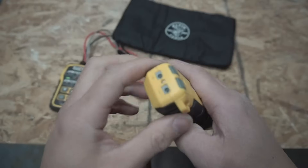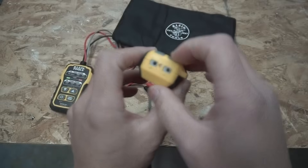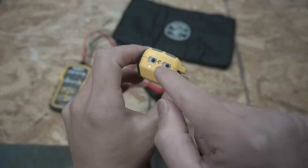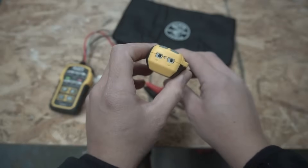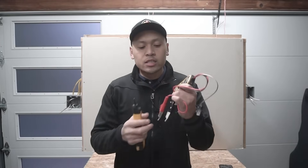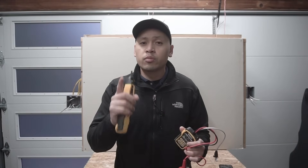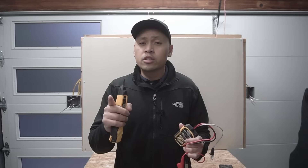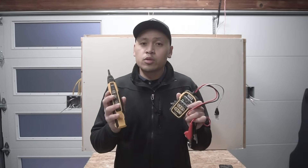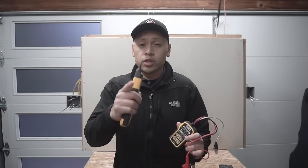The probe also has a verifier — once you find the paired wires, it will light up and confirm that's the right one. One very important thing before you start tracing: you must turn off the power from your circuit breaker. Not only is it dangerous, but it would also mess up your tools. Attaching this to a live cable will pretty much destroy it.